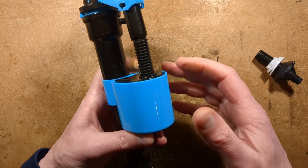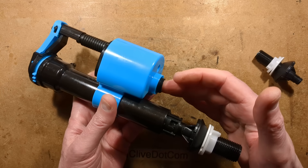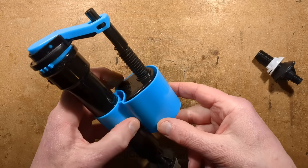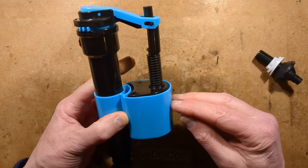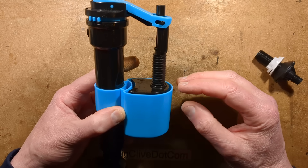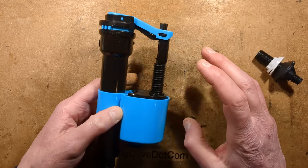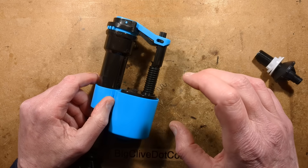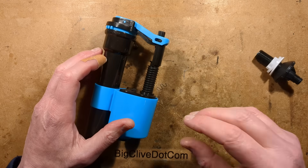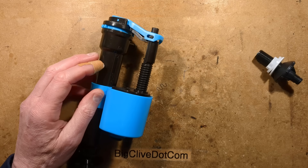There are other more impressive features. There's a little valve in the bottom here — just a loose plastic valve with an air pocket in it. As the water fills up, it pushes that valve closed, meaning the water can only overflow and operate once it reaches a certain height. Once it reaches the height of this float cup, it goes up very quickly. A warning in advance: this next bit is video inside an active toilet cistern. If you don't like surging water, you may want to skip over it.